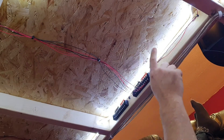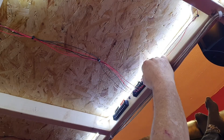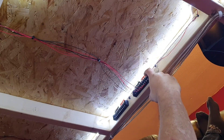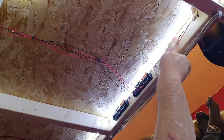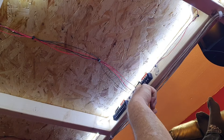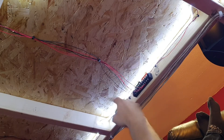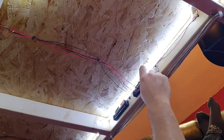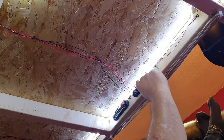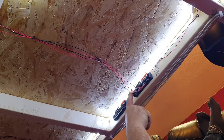I'll explain how it works. The red wire comes along and goes into pin 10 at the top. The black wire comes along and goes into pin 5, which is the black one on the top. Now to go from this one to the next one, I put the reds into top pin 6 and the black will go into top pin 1.